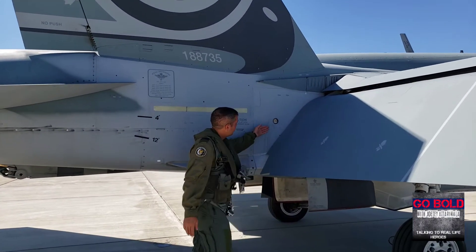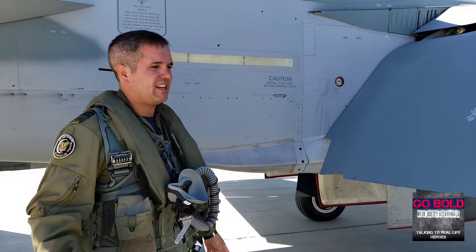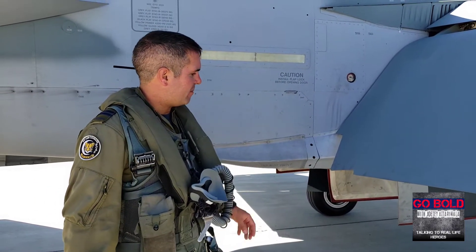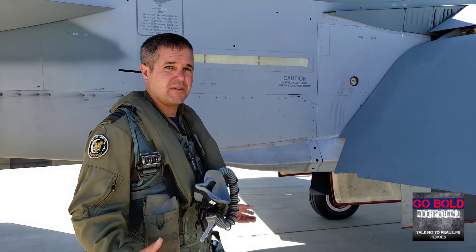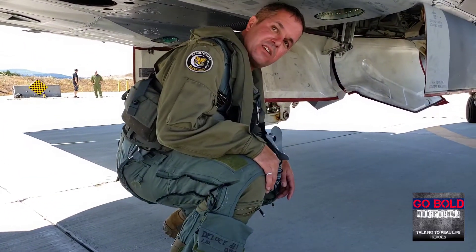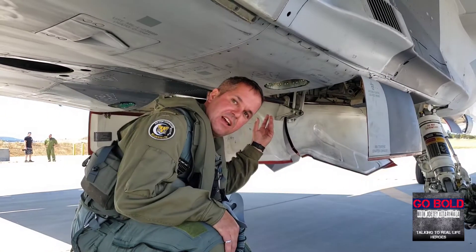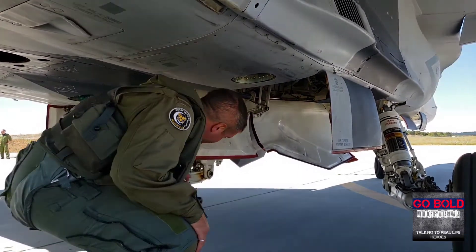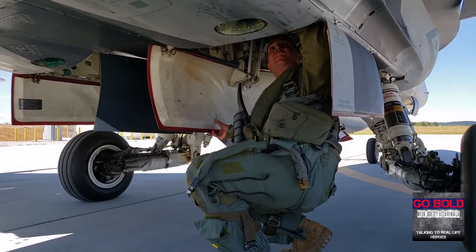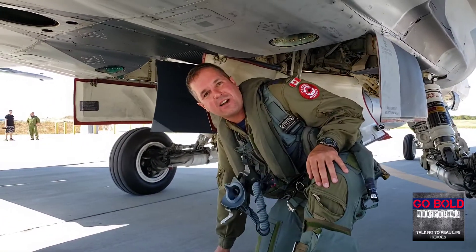We check the hydraulics indicator — it's green, but it's only really accurate right after the flight. You'll see a lot of times technicians will come and check after the engines are started to ensure you've got proper hydraulics for your right and your left. We'll actually go underneath and look for our hydraulic filters. We also have a handheld pump that we make sure is secure. And then we've got three filters here, and you're also looking for any kind of fluid leaks.